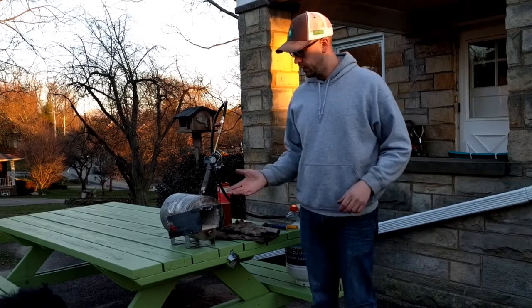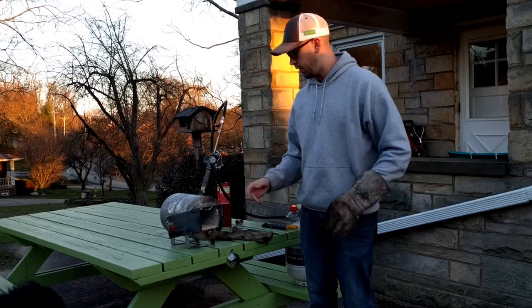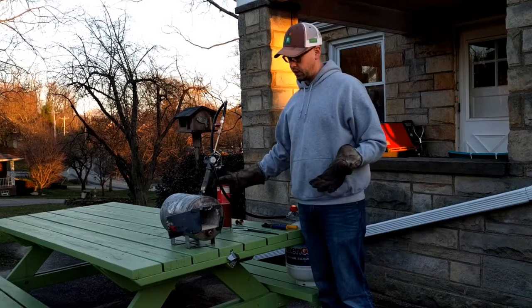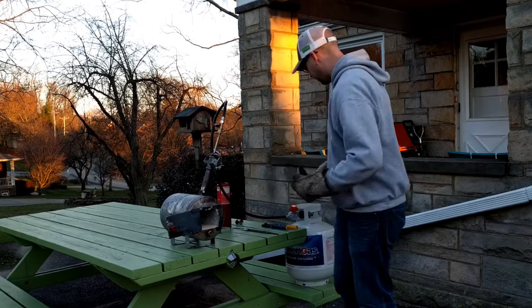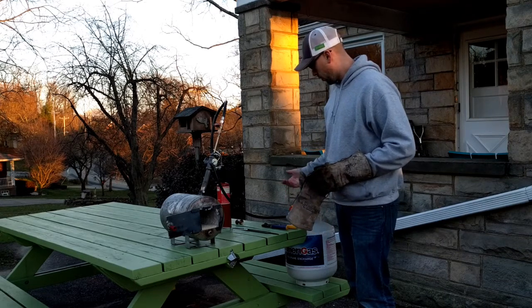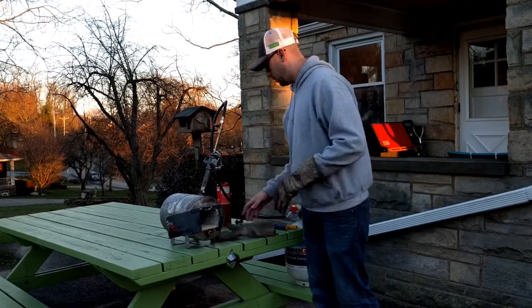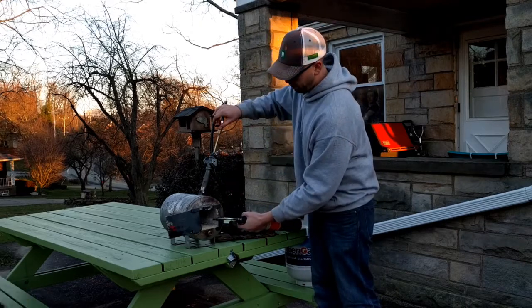It's finally time to light off the forge. The refractory cement has cured — it's been about half a day and we've done a pre-burn on it. The product says it doesn't need time to cure, but we didn't want to go full throttle right away. I've got the choke about halfway open and I'll set the valve to about a third of the way, around 5 to 7 psi, then light it off.